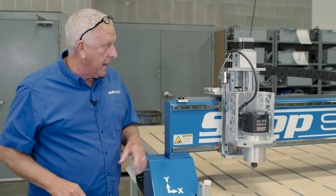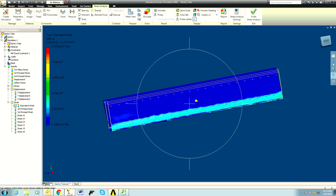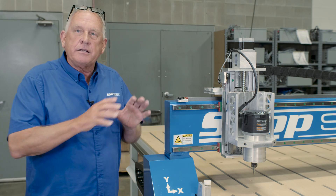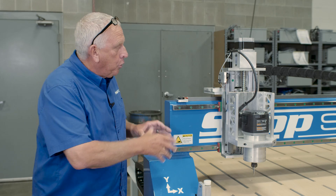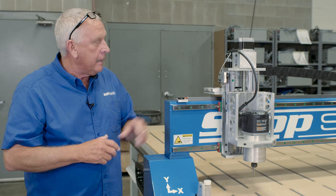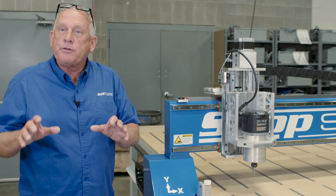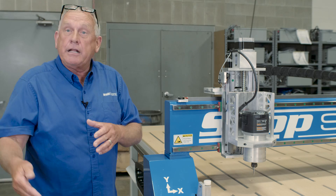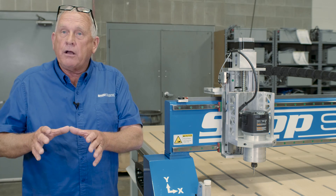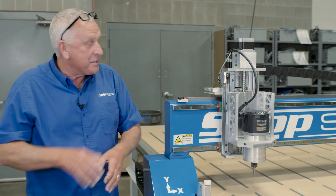There's something else really neat about this design. You'll see these unusual parts, and there's a story behind them. We use finite element analysis software to do all our engineering design and testing. We took some ideas from the IS Series and applied them here — we were trying to create more spindle rigidity down in the cut by adding more mechanical support. That's what these plates are; they form angles. We ran the ideas through the software, made the parts, and did actual testing. After achieving the goal, we then asked whether we could achieve the same rigidity by reducing mass — and the answer was yes. That's why you see those lightening holes on the design. You see a lot of engineering in these machines.